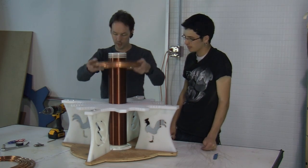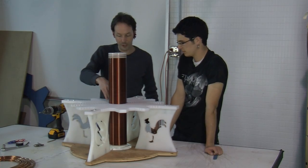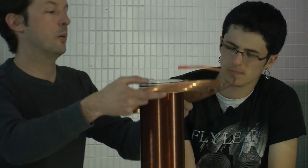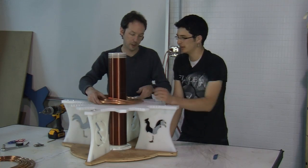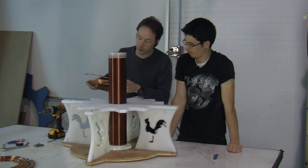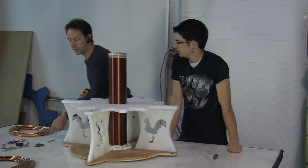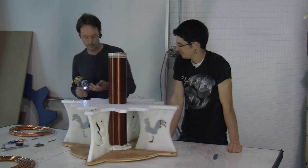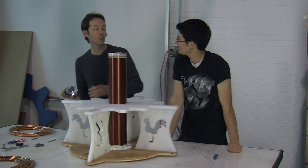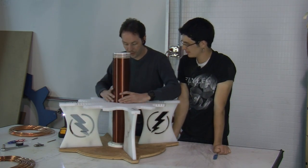So you drop this right over — first we want to make sure our coils go the right way. Our coils travel from inside to out going counterclockwise, so we're going to put our point that way. We're also going to have to drill a hole. Drilling the hole? Easy. Drilling the hole without drilling a hole in the secondary — that's where the art comes in.